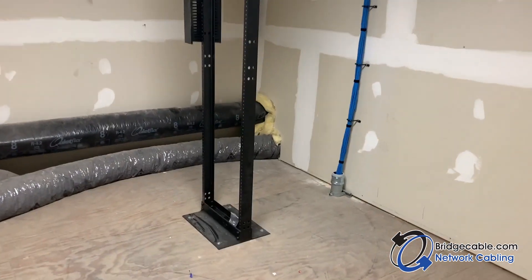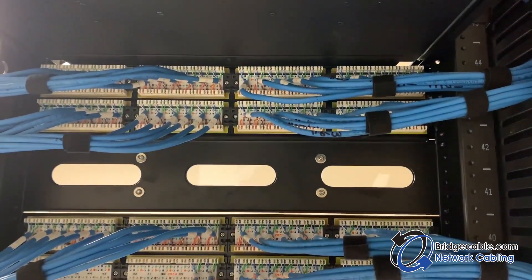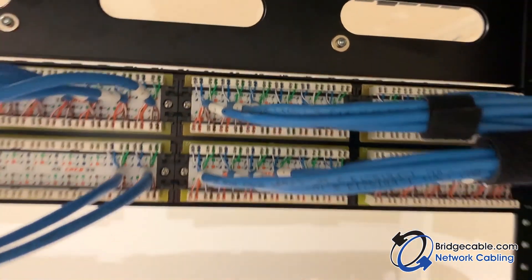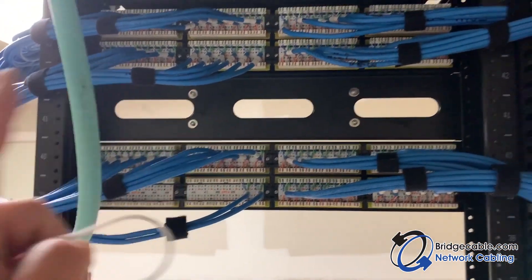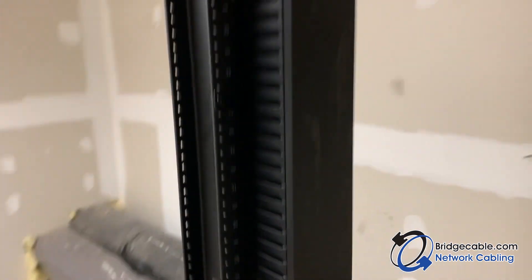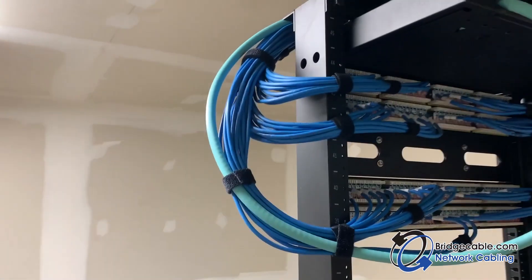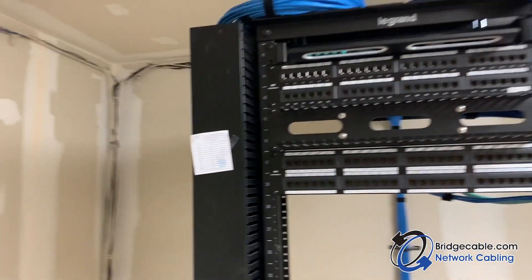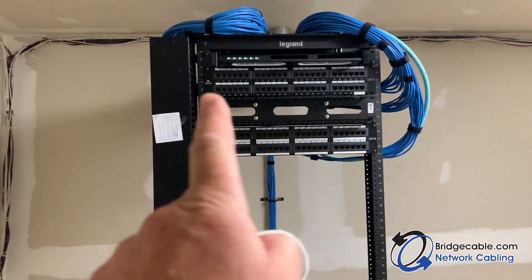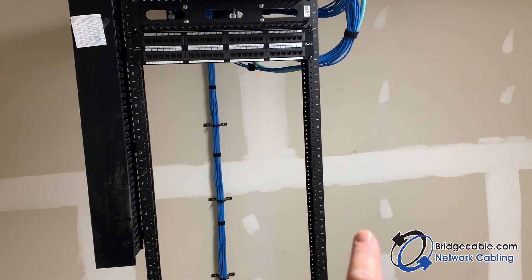Here we are with the completed rack. A couple of things I'll point out — look at those punches. Usually with a patch panel you want to just flare them out, feather them out. Most of the time we have 18U coverage, so it covers your main bundle coming in. You can see the opposite side too. I highly encourage everybody to get matching 18Us — doesn't that look better? This is a perfect example of a selling point.